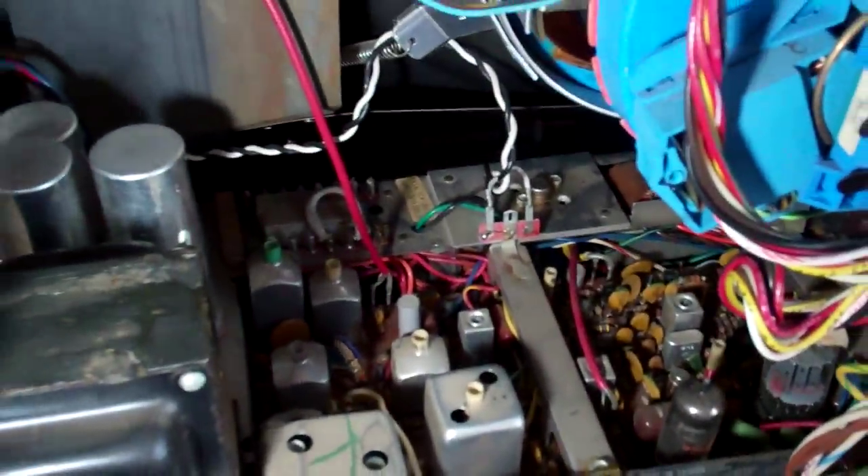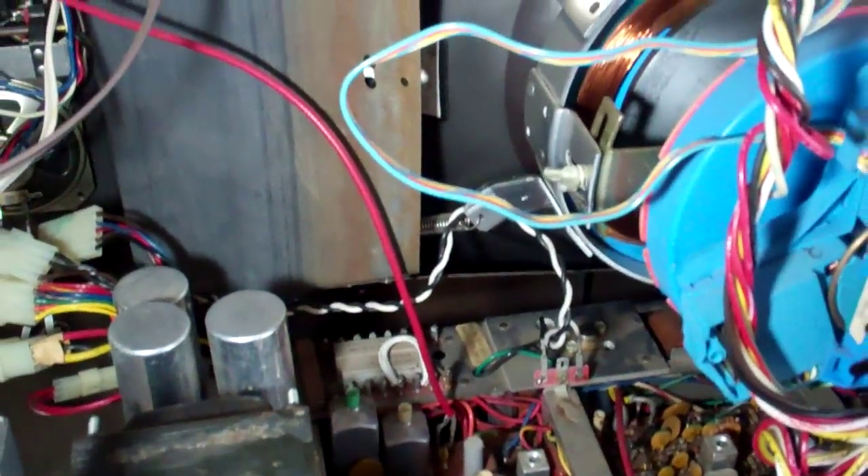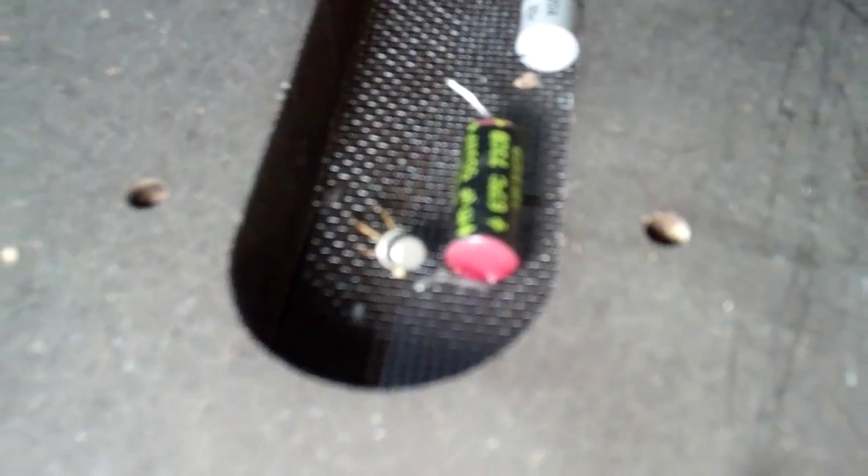Not a great picture, not great color. It did initially have a few bad parts, which are right there — the capacitor from the convergence assembly, the color killer electrolytic, and that little FET was bad.